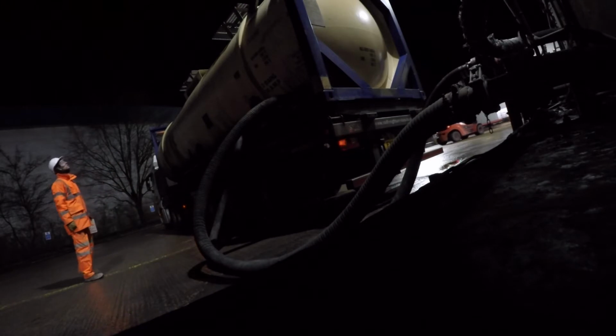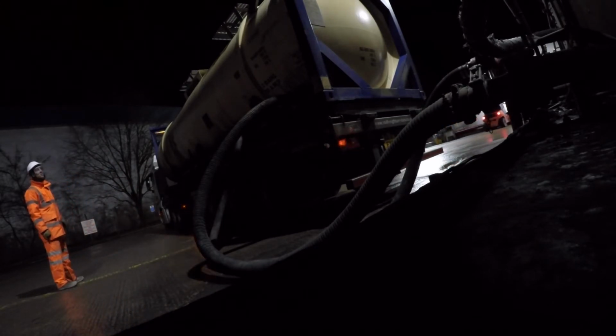Just keeping an eye on the pressures again, make sure it is climbing. It's a big old tank, but that compressor shoves in a lot of air. It only takes about 5 minutes to fill it up to about 1.5 bar. Another check, must be getting close now. The back pressure in the system is starting to show because the air's leaking out of the join in the pipe, so I'm just trying to get it into a better position so it's not making so much noise. Although it isn't critical really, the air compressor supplies more than enough air.